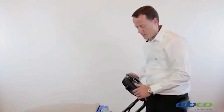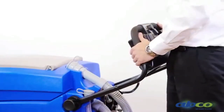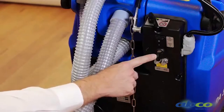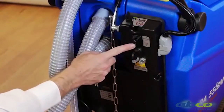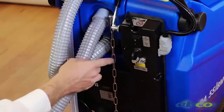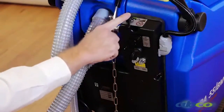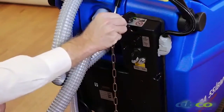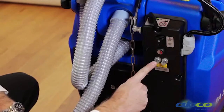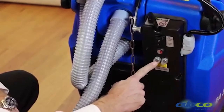For ease of operation, we can adjust the handle by unscrewing these side knobs, and then adjust it to whatever height is suitable for the operator. To go through the running of the machine, we've got our ignition switch here — we can turn that off and then on. When it's on, we will have the little orange light. We do have a drive switch here — please note that this drive switch needs to be on, otherwise the machine won't drive. The main reason this switch will be turned off is if you have to freewheel the machine to push it, which makes it easier to push. We've got our dial for water control, so we can adjust how much water we put onto the floor. Then we've got our circuit breakers here — for any reason the machine stops, whether it be the brush head or the drive, that's the first place to check, to make sure the circuit breaker hasn't popped out. You can simply reset it by pushing it back in.